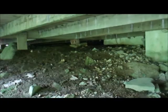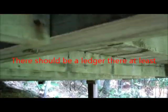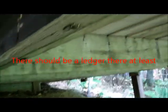A lot going on under here. The floor joists were just nailed into that with no clips on it, no ledger strip, no anything. And these nails have rusted completely through. They're non-existent right now, and the deck is falling through right there, and the only thing that's holding it up are the boards here. So I got situations here and issues galore.